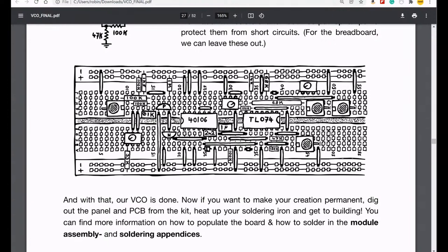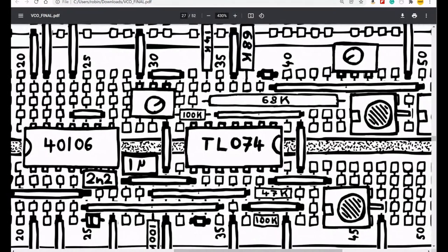But anyway, I put it all together, and I could get the sawtooth output, but I still couldn't get a square wave output, which now had its own part of the circuit, its own individual output. And this was most perplexing. I looked at it, and I looked at it, and I took things out, put things back, took things out, put things back. And I realized that still, that pin number 7, still not connected. And it has to be connected to something. There has to be something that it's connected to.